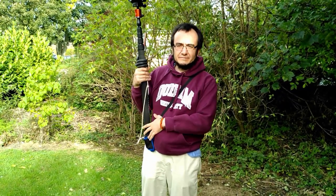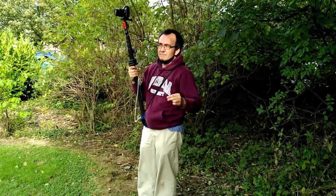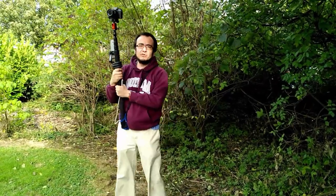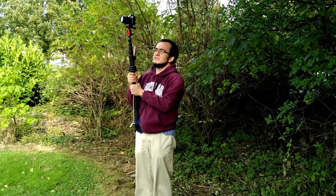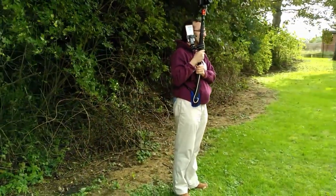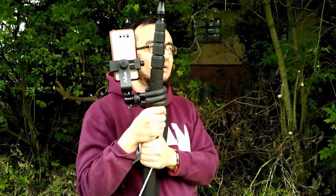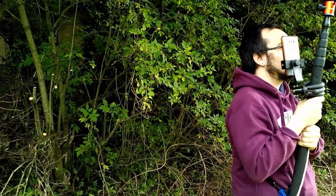We will start. Now, since it's very important to have a stereoscopic depiction of the church, for each pair of photographs we need to move around the church parallel to the walls. So instead of doing one photo and then rotating to capture the rest of the church, I need to move parallel to the wall: one photo here, one photo here, one photo here. You can move like this — one photo here, one photo here — and then move, taking one photo parallel and another like this and another like this.